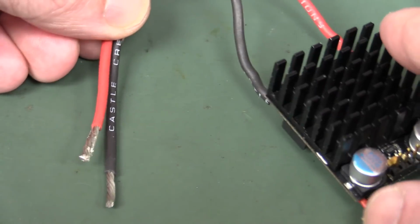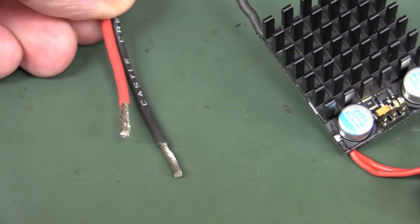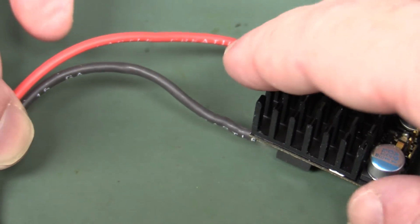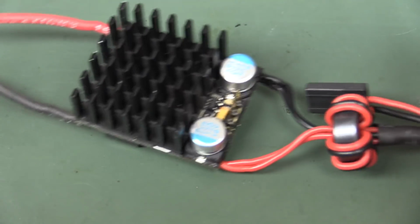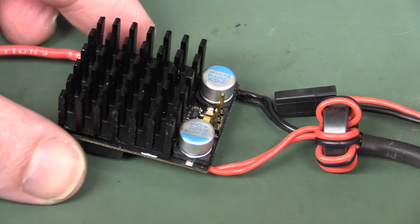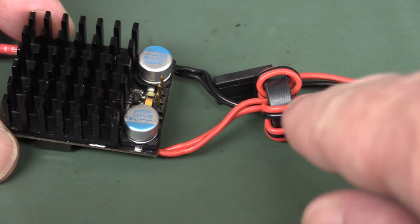And they've basically got the wiring on this a bit back to front. Look at the nice beefy 16 gauge wires they've got on the input here, but the input is going to be lower current than your output. The output, as you saw, this thing has a maximum of 15 amps. And then we've got two wires in parallel here.